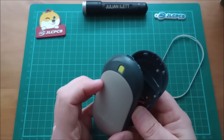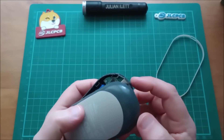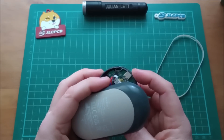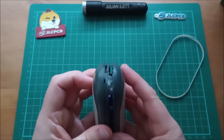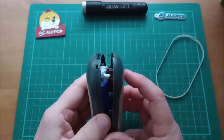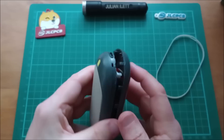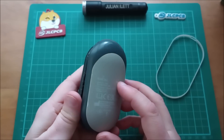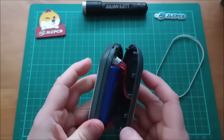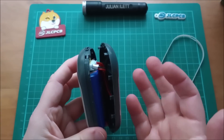This problem occurred, I think, because of the nature of this USB-C input and output. This thing is charged through USB-C, but it can also act as a power bank and supply power through the USB-C. So it's both an input and an output. And there were occasions where this wasn't really sure what it was doing, whether it was taking power in or putting power out.